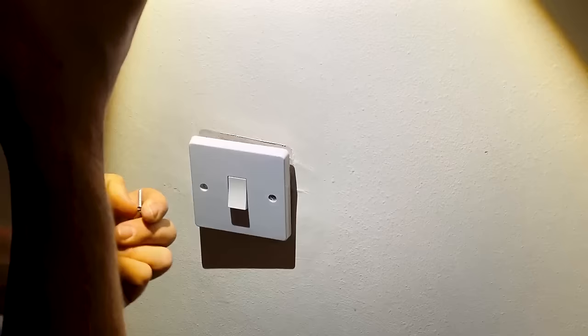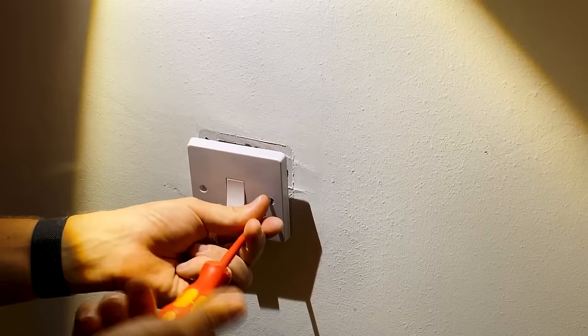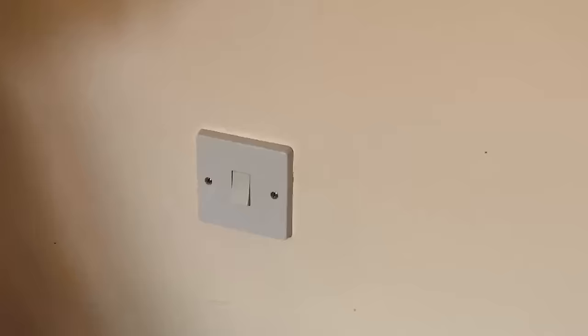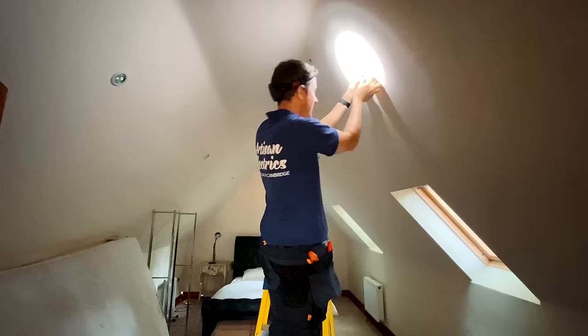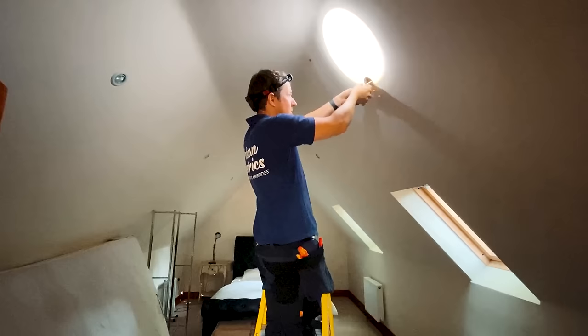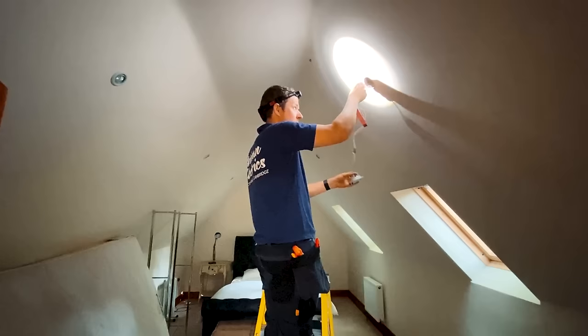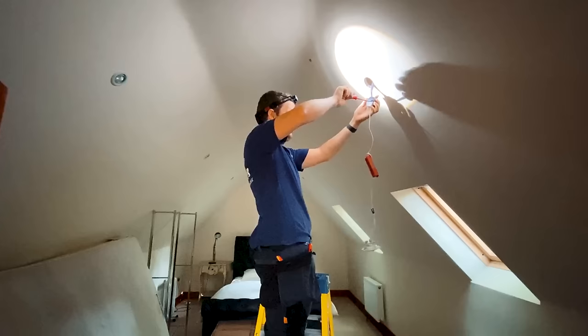Of course there has to be a cross-threaded screw. Every time - what do you do? Okay, so that's back. Let's go next door. This is the part I hate because you just know that when you take these out you're going to end up trashing the ceiling - although they're not fire-rated so that helps. So these are halogens with transformers and junction boxes. What are the chances that an earth wire and a neutral wire are just crushed together in the back of one of these junction boxes? There's no way you can have a short neutral to earth on the transformers because there is no earth connection on the transformer - it's class two - so this flex is just a two-core flex. So it literally has to be either a short on one of the cables in between, maybe damaged somehow, or it's in one of these junction boxes.